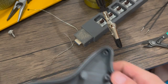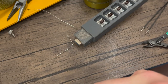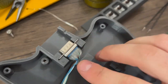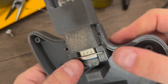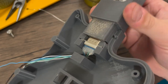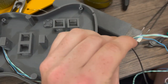This cable goes in this slot in the body. What I usually do is take this and bend it 90 degrees, create a little bit of space, put all the wires over to one side, then slip it in the slot and put it through — that gives a space for our strum bar to go in and everything else. Then I'll do a test fit, take the neck and put it in, just make sure everything slips together and holds, and that the neck is sitting in the right place lining up with all the holes. After that I'll take the wires and bring them around to about the area where I'm going to be putting the Pro Micro, cut off the excess, and put it aside.